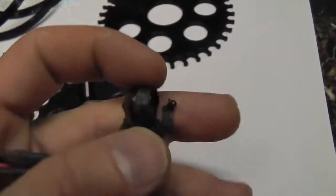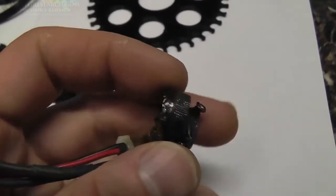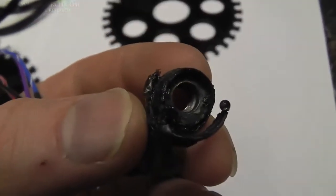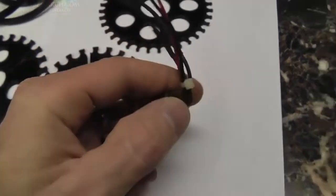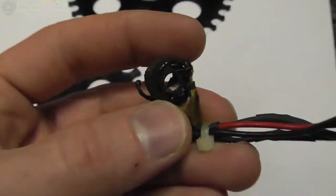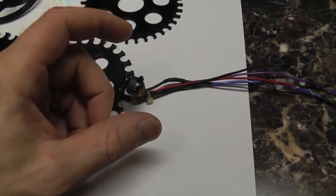But the Hotend, or the nozzle I should say, was basically recessed right next to the heating element. Now on the other one, it's really long. I wrapped one layer all the way through. This one I wrapped 3 layers thick, same amount of wire, same everything, same current and everything. So I actually really like this better, and I'll have to redesign that other one eventually, because what's happening is a lot of the heat dissipates up into the top, and that's an issue.